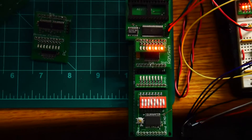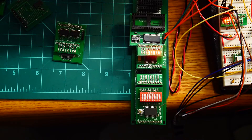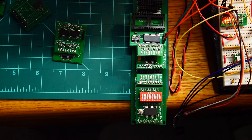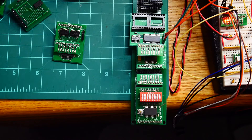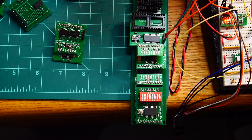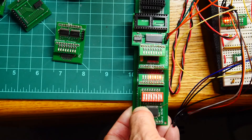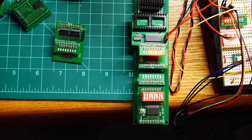Let's zoom out a bit so you can see both boards. We have zero on the bus — we can clock that in, so we put zero onto the address. If I can balance this here... I really need to set this up better. So if I put something on the bus and then clock that in, there we go — it gets clocked in and remembers it. That seems to be working fine.